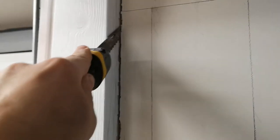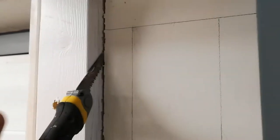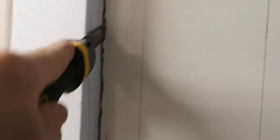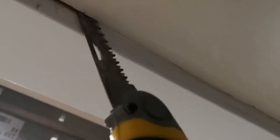After you've defined the cut between the plasterboard and the door frame, get your drywall saw and saw all the way down along your scribed line. What you'll notice is a lot of dust coming out of that cut, so you're going to have to get your vacuum or extractor ready underneath the blade to catch all the dust. I started this cut at the top of the door frame and I'll show you a typical example of how much dust is created.